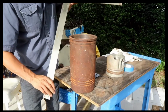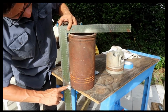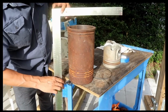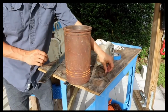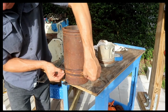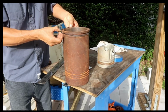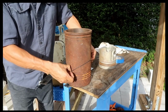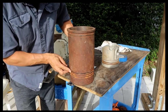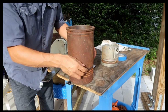Another dimension that is critical is the length of the sleeve, especially in order to avoid that the sleeve touches the oil jets. The length of the sleeve should be exactly the same. You need to verify that the O-rings in the new sleeves enter appropriately. And you need to verify that the O-rings are original O-rings, verify the color of the O-rings, and verify that all of them enter in the grooves that you have on the sleeve. This is an important and critical part.